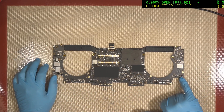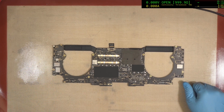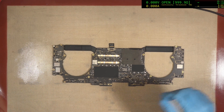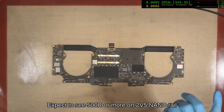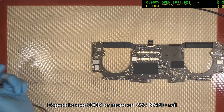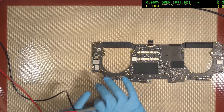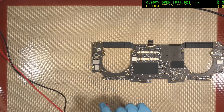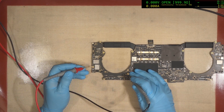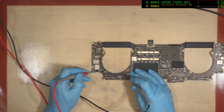Time for us to check it. I can actually see there's a little bit of damage down here, which is right on the area where the regulator is. So let's have a look and see what we get. We should be getting around about 400 ohms to 1K for each side. So over here we've got one of the regulator sides — this is the 2V5 NAND.